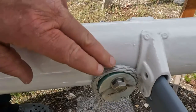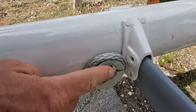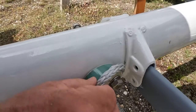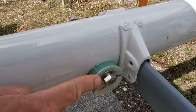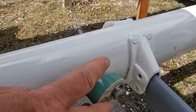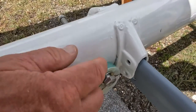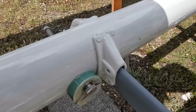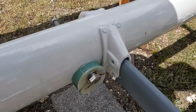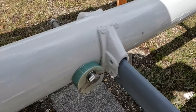Clearly what I need to do — and I'm going to be doing this hopefully this afternoon — is building a jig so I can make those holes entirely repeatable. The other thing I mentioned before, and I've changed my mind a little bit on, is that I hadn't fitted end plates. What I'm going to do is fit end plates on both sides — both the outside and the inside of these FR4 discs — and they will go up as close to the spreader as I can get them and still be able to fit the loop over. The two end plates will be joined by a little Dyneema lashing.